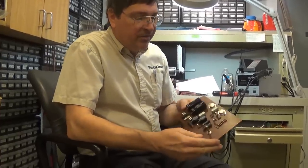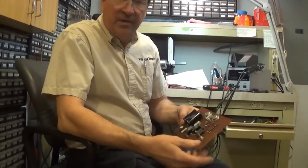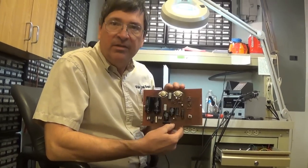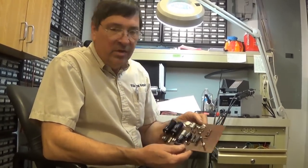When you're reconditioning one of these older things, you want to check values of certain things, like resistors. And you want to check for cold solder joints, because that happens a lot on this stuff because of age. The reason for it is the metal deteriorates. Dissimilar metals don't want to stay bonded to each other. Aluminum against steel, you're going to get a white powder, because steel is actually going to win, and it will generate electrolysis, or if moisture gets in between the two, the aluminum will deteriorate into a white powder. Rust is a form of degeneration when you put different steel against other steel.